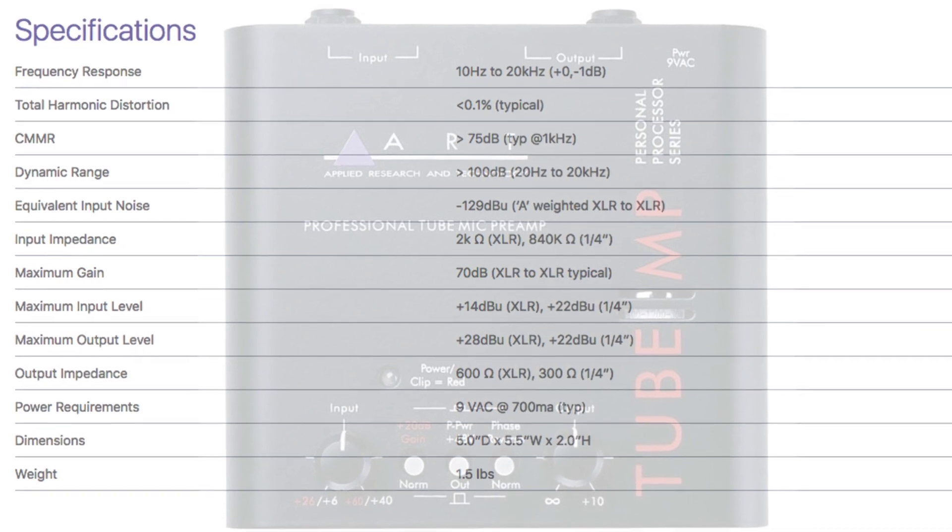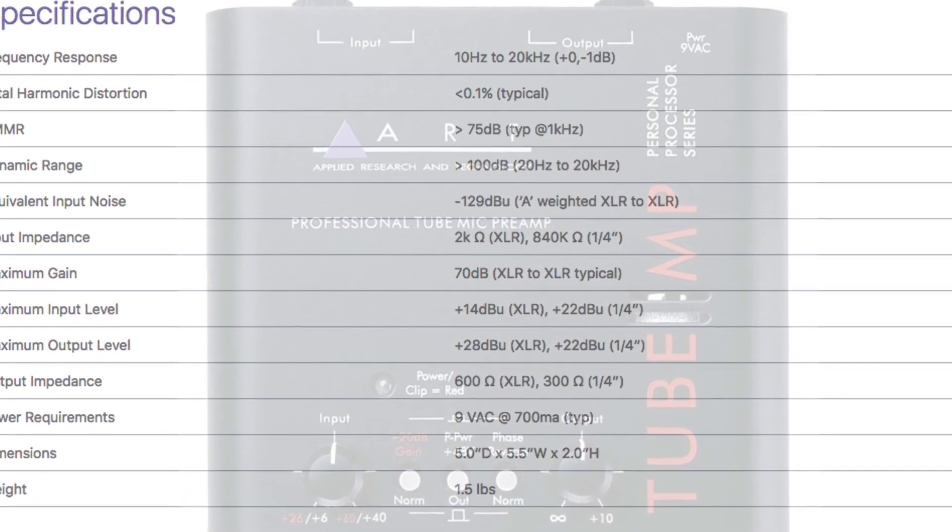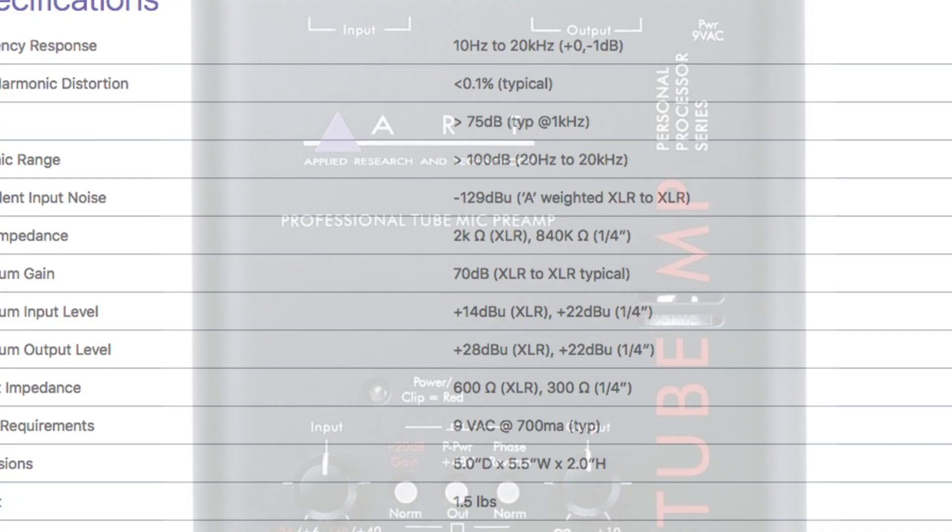Although the steps are the same for any preamp that you want to calibrate, there is one caveat. You must know the input impedance of the preamp that you are about to calibrate. That information should be readily available at the manufacturer's website — look for an input impedance of between 1200 and 1500 ohms. Today on the ISA-1, we'll be dealing with an ohmage of 1400 ohms.